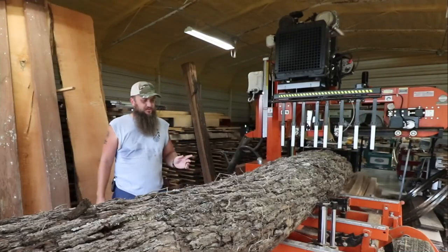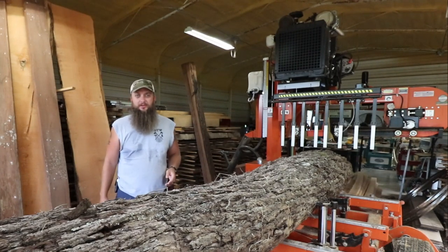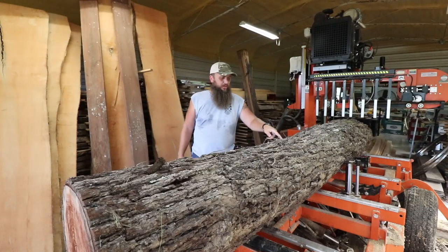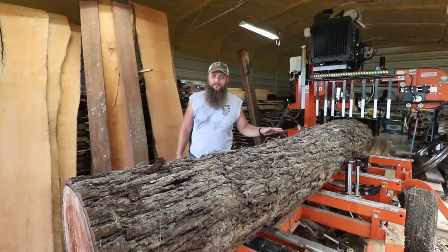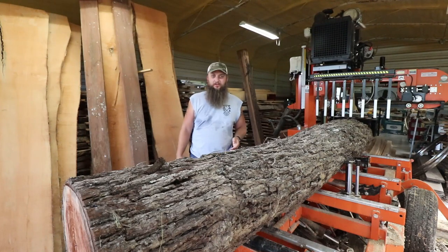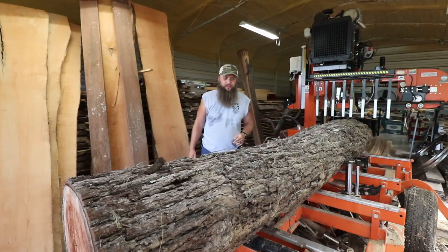When it's done in the kiln, we'll take it out and I'm going to be building them a farm table with this wood. We're going to be sawing this at six quarter. I'll be squaring it up as well - I don't want to do live edge slabs or anything like that. I'm going to be doing grade sawing. So I've got the best face on top right here and I marked it on the end grain as well. We'll take the top cut on the best face, flip it 180, make another cut, then square up this timber. You want to get as wide as possible - we'll square this up, set the AccuSet for six quarter and start going down through here and get this thing done.